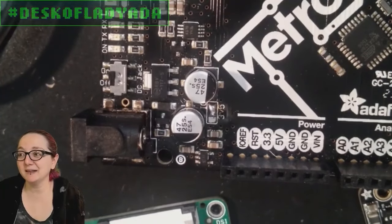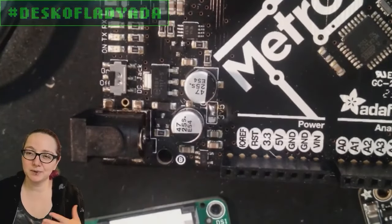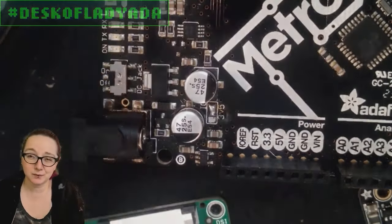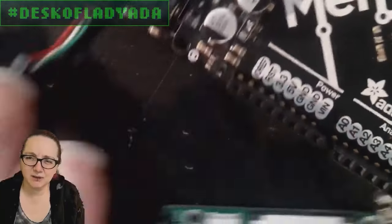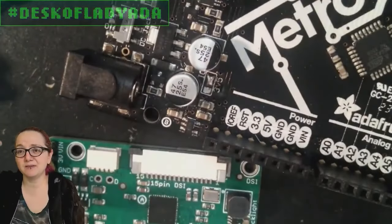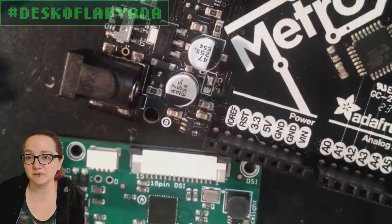I mean, tantalum is a rare earth metal, and it's complicated to make sure that you're getting it ethically sourced. And also they're much more expensive. So I don't really use tantalum at all. I don't think I've used it at all. I basically just use electrolytics when I need 47 and above, and for anything below, I use ceramics.